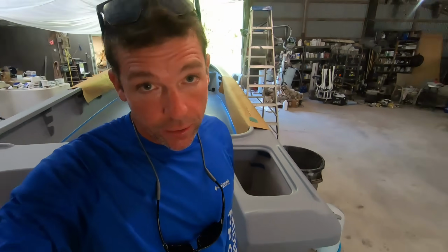So we got our base coat down, rolling on a coat of the non-skid, and then we're coming back over it tomorrow with some gel coat that has the modifier C, the wax additive, added to it. So it sounds complex. It's really not, but hopefully that saves you guys some experimentation if you're trying to figure out how to add non-skid into gel coat.